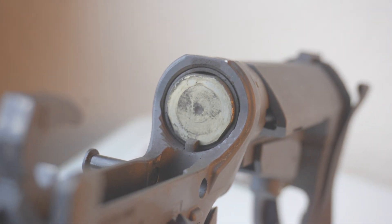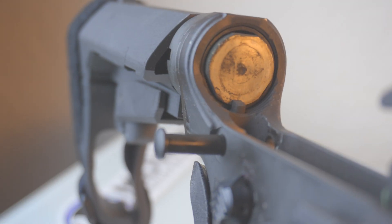Moving to the buffer area — one common issue in the AR-15 world is the retaining pin for the buffer, that little nipple on top, which snaps off for some people. Vector identified this as one of the more common failures in the AR-15 platform and went ahead and reinforced it. They made a thicker retainer on top and angled it so that as the bolt travels, there are no major issues. That was something I thought was really, really nice.